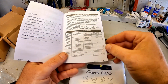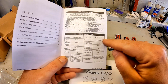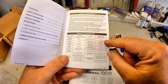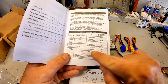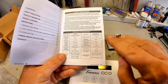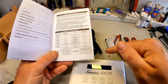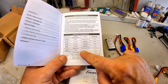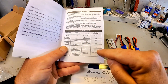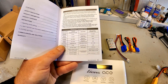Looking at the parameters in the book, a couple things I really like: 5-amp charging — very important. That 5 amps plus your 100-watt max is really what gets your battery charged fast. The other thing I really like to point out is discharge is all the way up to 1.5 amps — that's higher than you get in a lot of chargers and really helps if your batteries are up higher and you're trying to get them back down to storage. You also have up to 6S capability, and yes, it will do LiPo, LiFe, high-voltage, plus nickel-metal batteries.